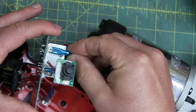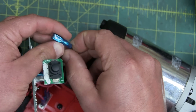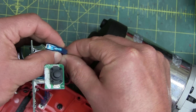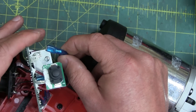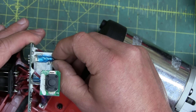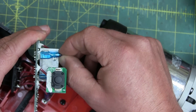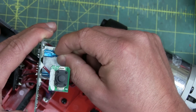Why did that come off so easy? Assembly problem. So if you've got a dead-on-arrival unit, first thing you check is the fuse. Secondly, see this? The heat shrink tubing is loose on there. The assembler was pushing on the jacket instead of pushing all the way down on the spade to get it properly connected. You've got to pull the heat shrink back and get it to properly dock.